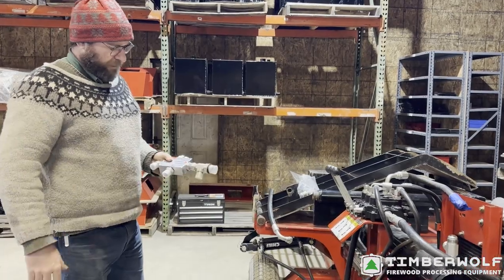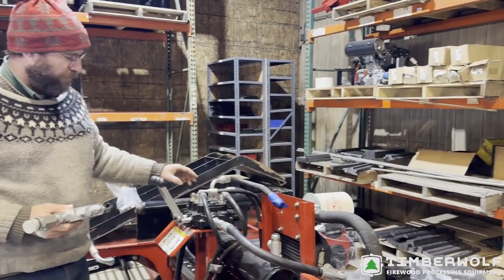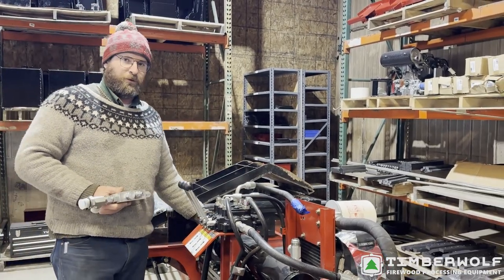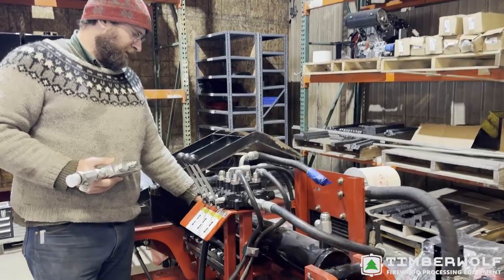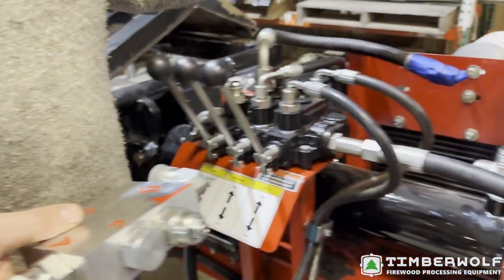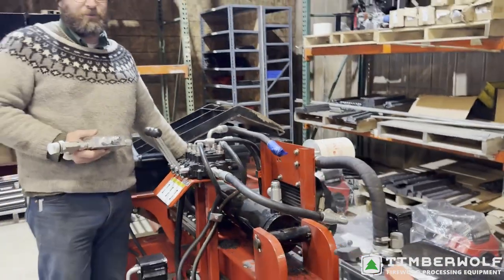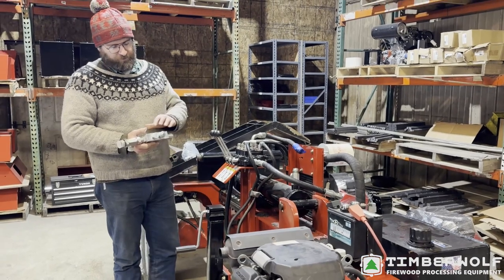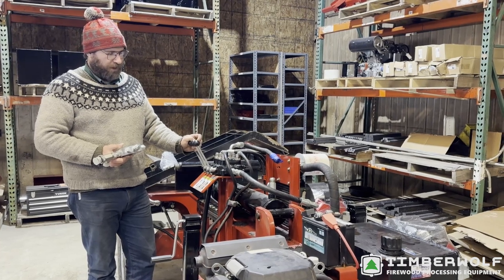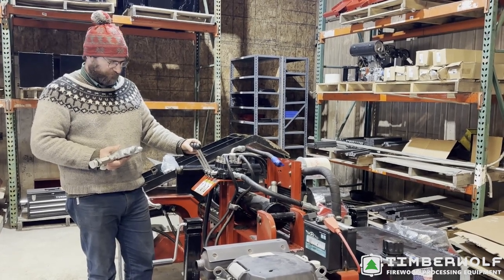We're machining this ourselves in our upper machine shop in Syracuse. What it's going to do is go right here — as we put fluid from the A port into there, that'll push the cylinder forward, forcing fluid out of the B port. From the B port, the fluid instead of just returning to tank, this valve will open up and divert the fluid from the front into the back, making it go about twice as fast because of our two-to-one ratio on this five by three-and-a-half inch cylinder. Once it reaches 1500 psi, that'll shut off to give you maximum split potential, so it will slow down — but this should make the alpha cycle times hopefully in the low five seconds for the five inch cylinder.